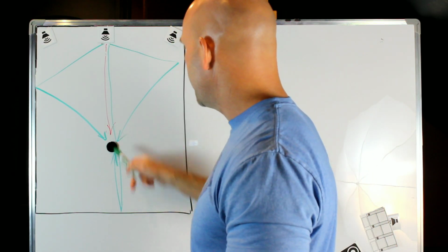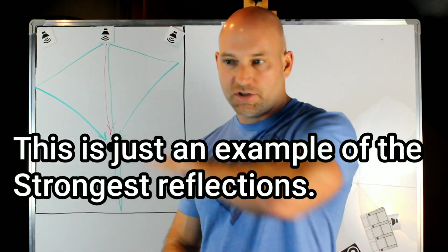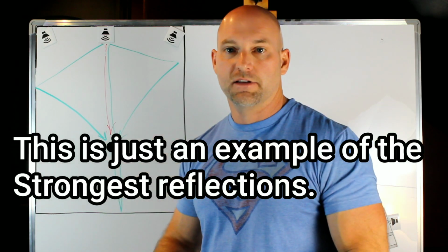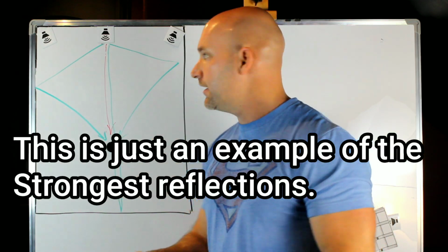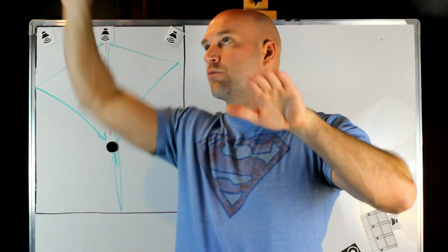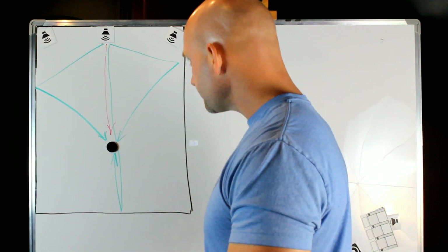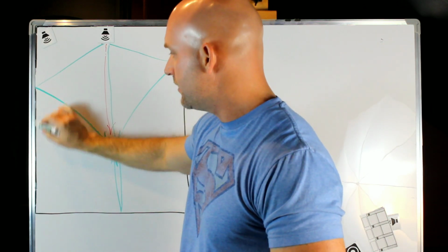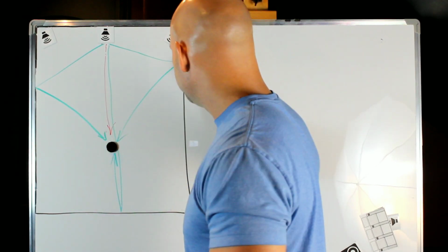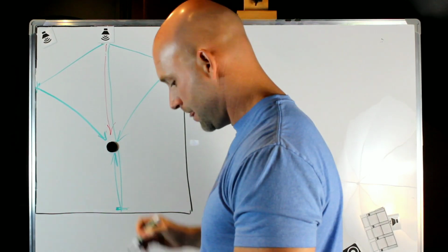floor, but you could have one from the floor if you've got nothing down there to absorb anything. So that's 3 reflections from this one center speaker just on the horizontal plane and the ceiling, 4 if you count the ceiling. So that's not including anything on any other plane. You've also got reflections bouncing off different angles to the seating area here. Now, of course, these are going to be the ones that are the most important to treat. The ones here at these reflections back here.